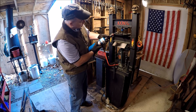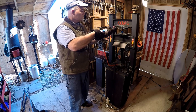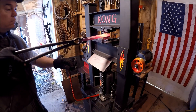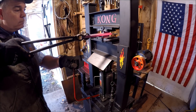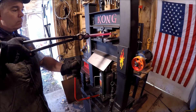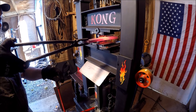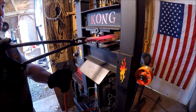Here we get started — we're at the forge heating up the dies because we're going to be using the hydraulic forge press to fuller out the snakeskin billet so it's an appropriate size for the skinner blade. We put two three-quarter-inch round dies in there to work that billet and widen it out. We're hoping for something about two inches wide.